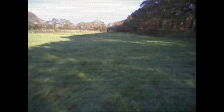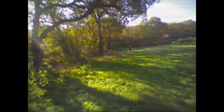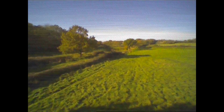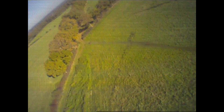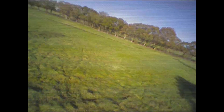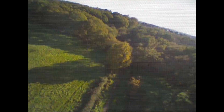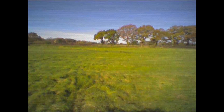It just looks like I need to do something with the PIDs to mitigate this. The higher-voltage 3S was definitely interesting — it had a lot more power and really wanted to go, and it seems really quite nice at fast straight-line speed. It still has an issue with the climb out, and when you dive you've got to bear in mind the extra weight for recovery — whereas your normal micro quad can stop a couple of inches from the ground, this one has a bit more inertia. But it's still vastly better than flying on 2S.